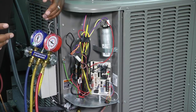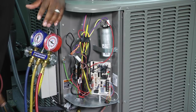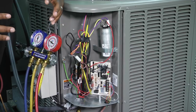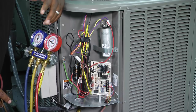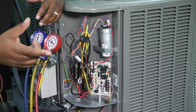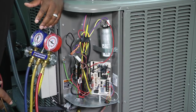You also have to educate the homeowner that the sprinkler system coming on is not the proper way to clean this coil. So just because they have a sprinkler system doesn't necessarily mean their coil is getting clean. Especially here in Texas, we all want nice, beautiful lawns that are mowed once a week, sometimes twice a week. And every time that happens, whether from ourselves or our neighbors, we can find that our coils have now gotten impacted with all of that dirt and debris.